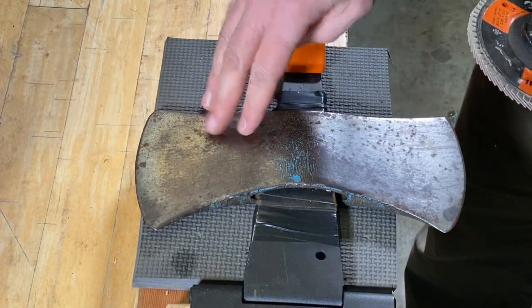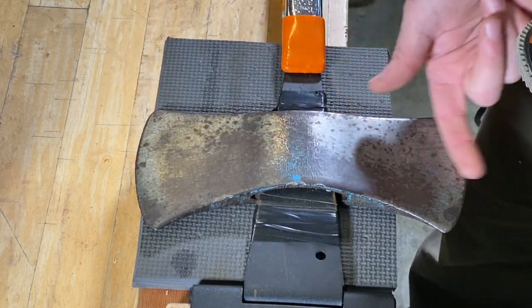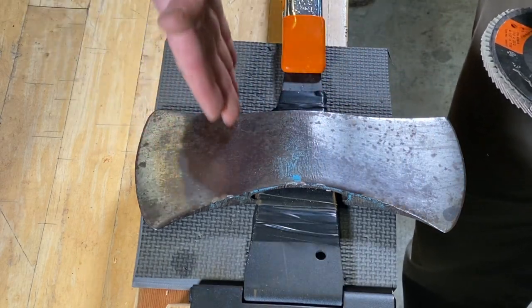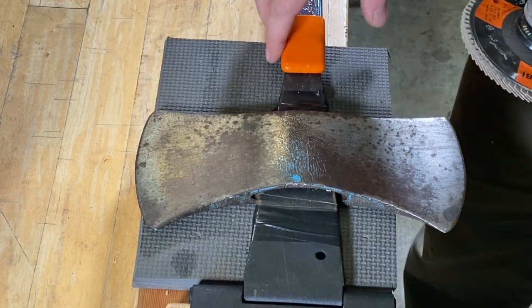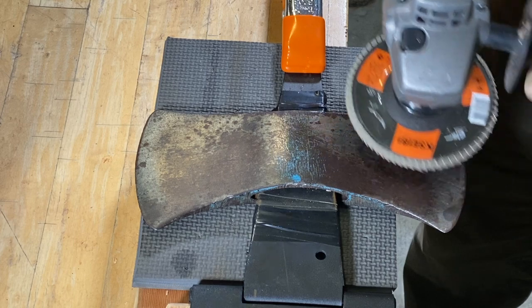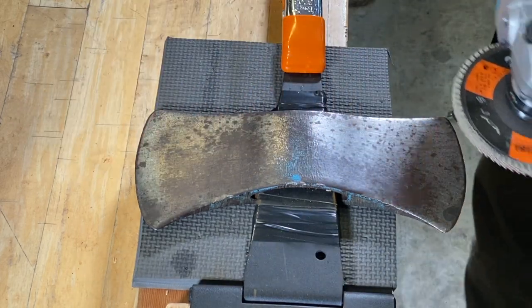And so then when you work over to the buffing wheel, the buffing wheel is spinning like this, and it's also putting lines in one direction. So you're not trying to get out lines that are going all over, swirls and all that kind of stuff. And as you get into it and start polishing it up, you hold it up in the light, start looking at the scratches, that type of thing.